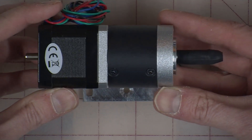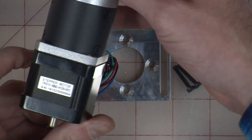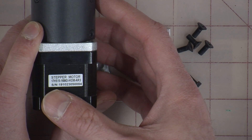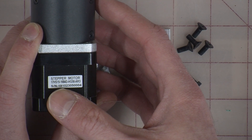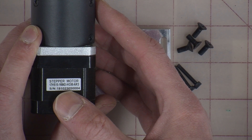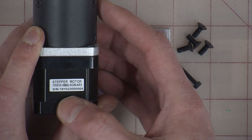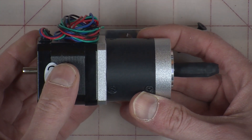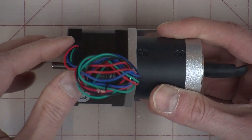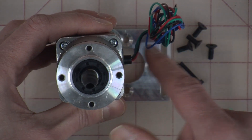The J3 motor looks like this. It's the last of your big beefy motors. It should come with its protective cover on it. The number you can see right there — 17HS15-1684D-HG50-AR3 — is how you know it's the right one. Your serial number will of course be different. What you've got here is the motor, the gearbox, and the output shaft. The wires all come out of one side, and that's going to be important later because you'll want to make sure when you mount this, the wires are going off to the right side — literally to the right side.